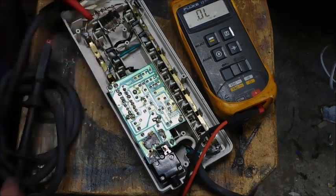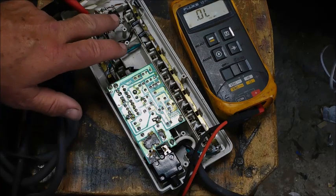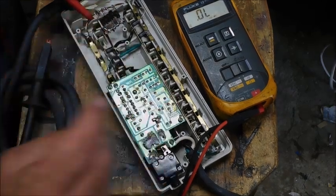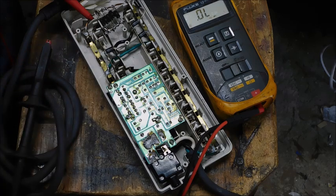So this did exactly what it's supposed to do. I'll find the bad component in here — I pop each one loose till I find it. It's probably only one, might be two, but that took the brunt of the problem. It doesn't show up here because the breaker kicked out faster than it could cook, so it did its job.